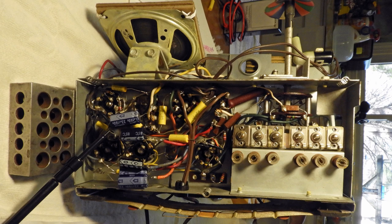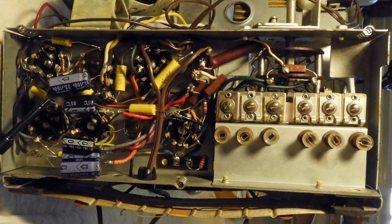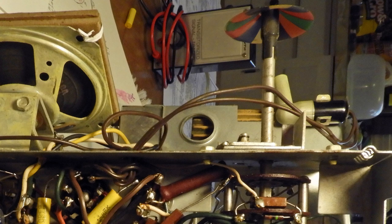Here's a look at the chassis of this radio. You can see the speaker at the top left, and in the lower right is the tuning. Here's a little bit closer look at that part. And if you look just above the tuning on the right, you can see the rotary switch — when you step on that bar, it rotates and selects the tank circuit for a particular station.